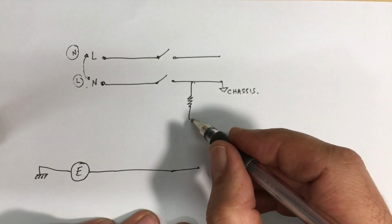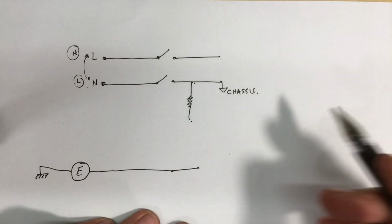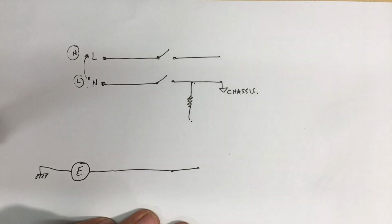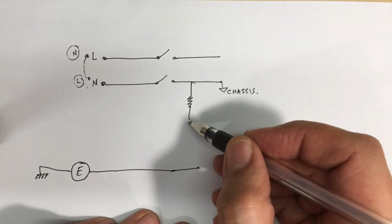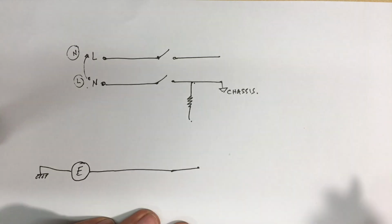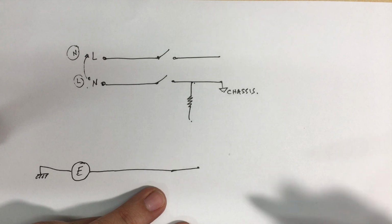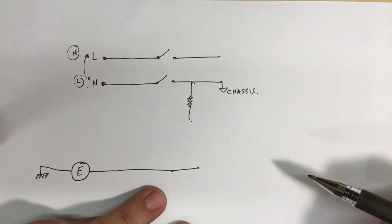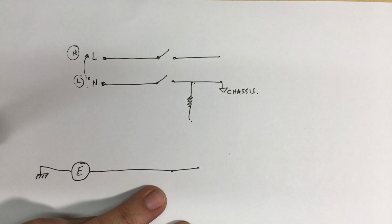What I've done is I've gone one step further. I saw a very interesting video by Bigclivedotcom, and I'll try and remember to link that in the description below, where he shows various types of indicators using LEDs. You have to be careful with LEDs, because if you put an LED straight down to earth and you have 230 volts across it, you limit the current, but the reverse voltage across the LED will be high and it'll blow the LED. Usually they take about 5 volts, except the really old ones, but we won't go into that.